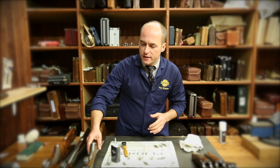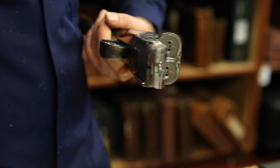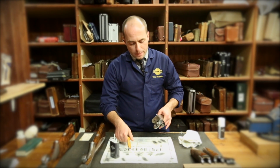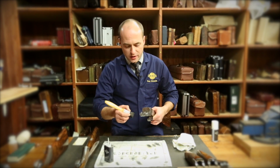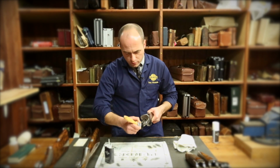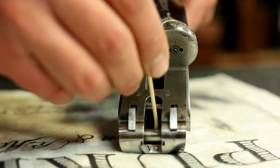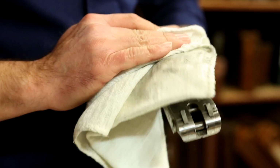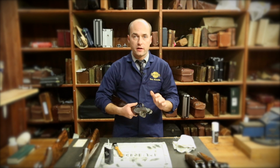Moving on to the side by side, the techniques remain the same, but you are looking at the barrels on the side by side, which obviously go into these two slots here, the two steels. And again, you can get the build-up of debris, dirt, everything else I've already mentioned. So again, straight in with the paintbrush, loosening, removing, generally cleaning, and again, the cotton bud down underneath everything, getting any nastiness out. Again, wiping over, mechanical check, making sure your pins are still nice and tight.